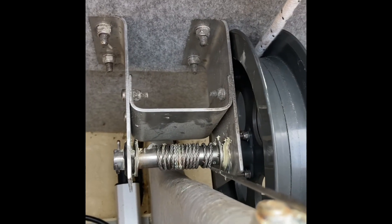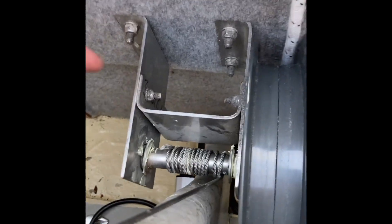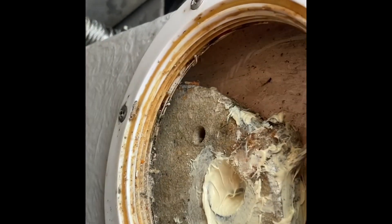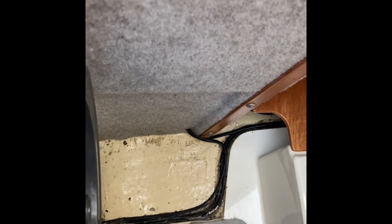The new wire's in place and wrapped around the winch, and this one's ready to go and be re-wrapped back on here as I lower the centreboard. So it's packed with grease, and just some more grease around here to make a seal, and a bit more grease on the top. Then I think we're ready to put the step back.